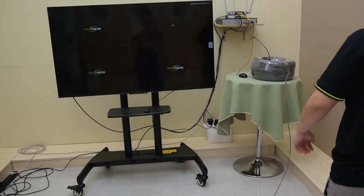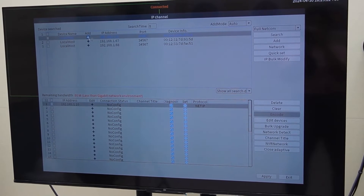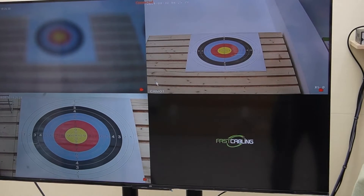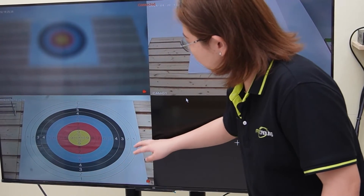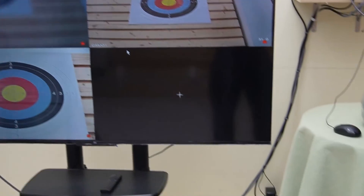Now it's time to go back to our monitoring site and display the video footage. After hitting the search button, we have three cameras — let's hit the add button to simply add them to our channel. They're already connected. Now we can see three targets, and one of them is very clear with rings 1 to 10 visible. But another one is very blurry, which is why we have to adjust the focal length using our adjustable bullet camera.